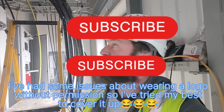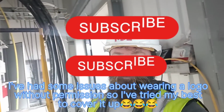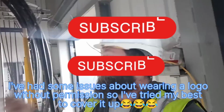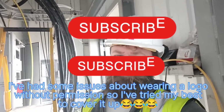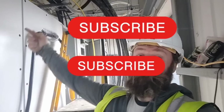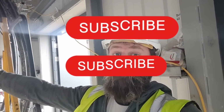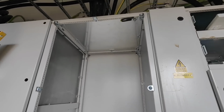Right then. You see them? 630 mil singles. So they come from underneath. We've had a right mess about pulling them in. Underneath, up the back of the panel, and then they're going to loop over the top into it. So we'll have a look in there now. Got quite a lot of room.